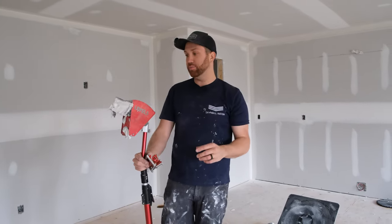Going across one direction to finish that half, then coming back to do the whole thing over again. Because I'm working inside two walls I'm going to have to lift off in the middle somewhere — unlike an outside corner where I could pull past the corner bead. I can leave a flip somewhere in the middle, or what some people do is carry the corner box right to the outside corner and tilt the box down to get right to the three-way. I'll slow it down to show you, then do it faster going the other direction.